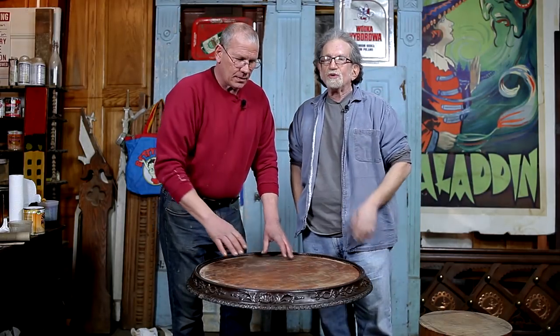But the de-wax shellac, if you remember, we put some in a container, and the milky liquid is the wax kind of substance that's not good to put on a surface if you're going to put a poly on it, because there are adhesion problems. Right, but the sealer coat is literally making it easier to adhere the poly to the wood. Well, the de-wax nature of letting that stuff settle and then spooning off the top clear liquid, that's the de-wax shellac.